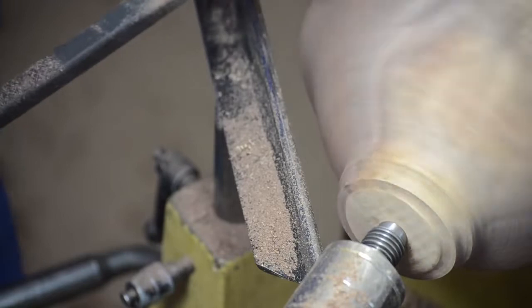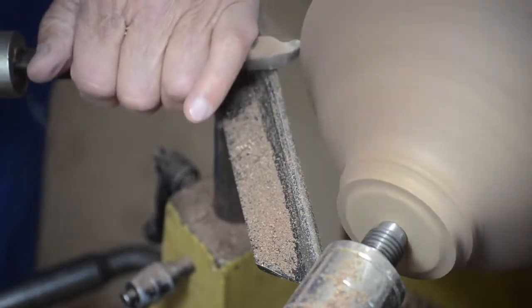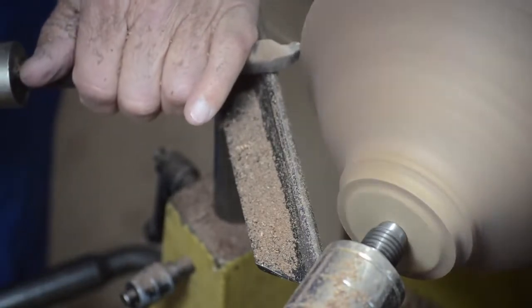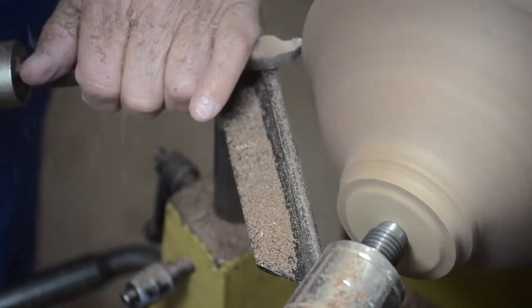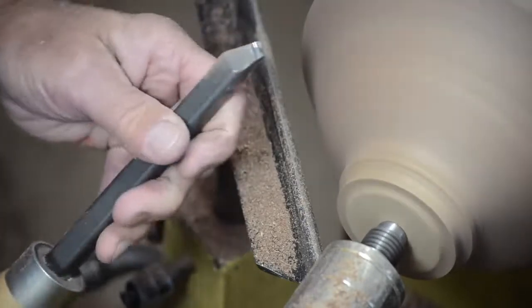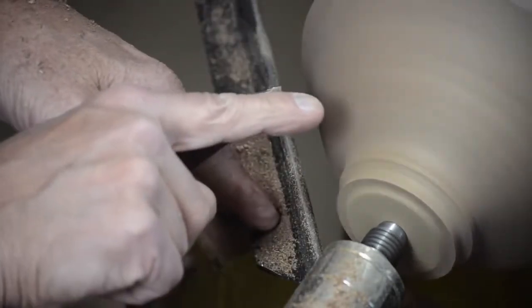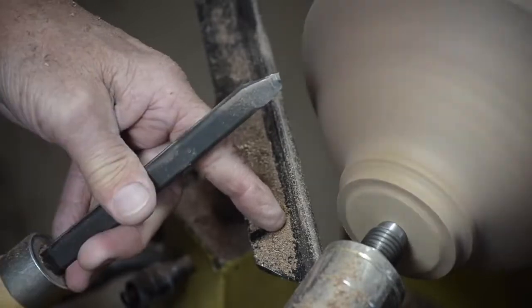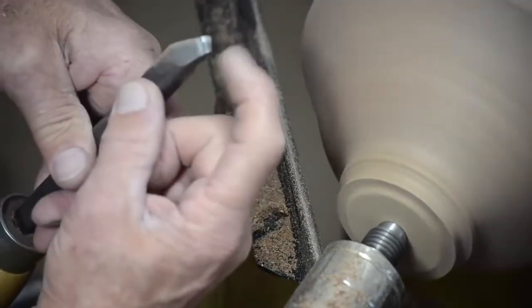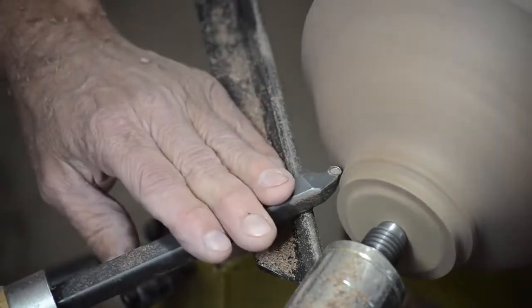The rim is not quite done, but I'm probably going to end up flattening it. But I'm going to take off a little bit more just to make sure. Now one thing you'll probably notice — I didn't mention in the early part — the cutter is tilted downhill. And that's what allows it to cut as a scraping tool without getting a big catch. You can also use this kind of a bevel down here to control the cut and not be quite as aggressive.